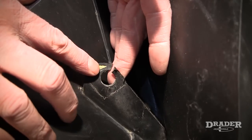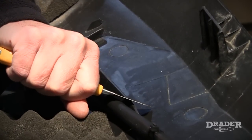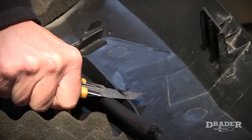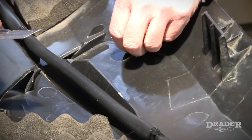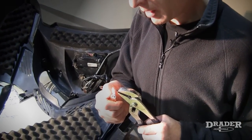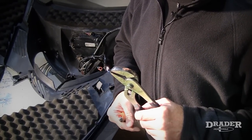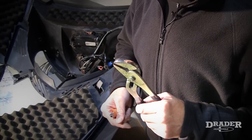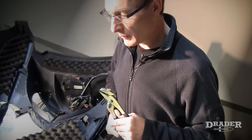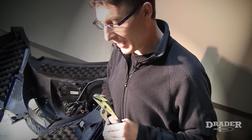Here's another piece that needs to be repaired. I'm going to try and figure out what type of plastic this is by taking a little piece off, and then I'm going to do a test on it. Now I'm going to take this piece of plastic and set it on fire, so I can smell the smoke. It smells like polypropylene to me. Polypropylene smells like the back end of a diesel bus.